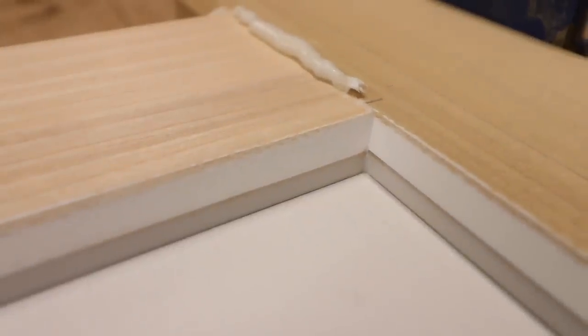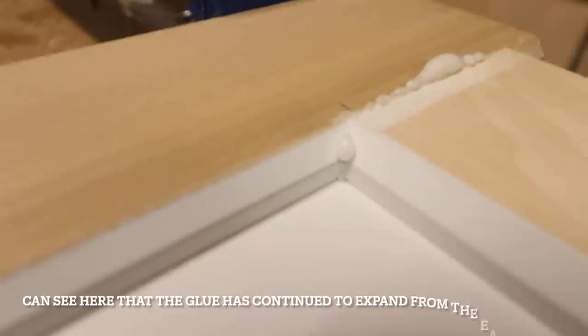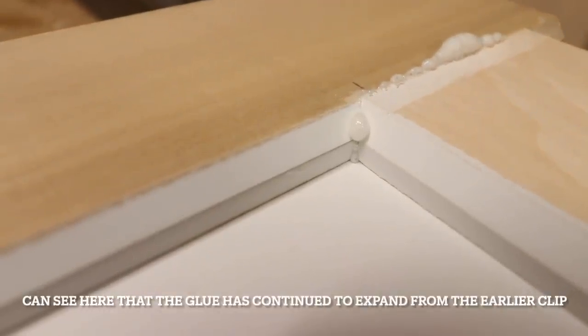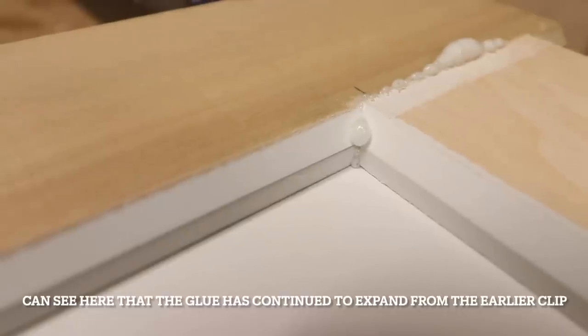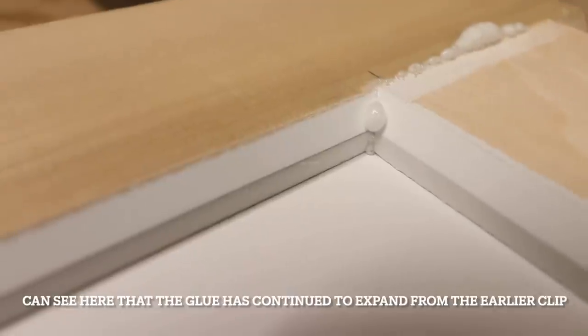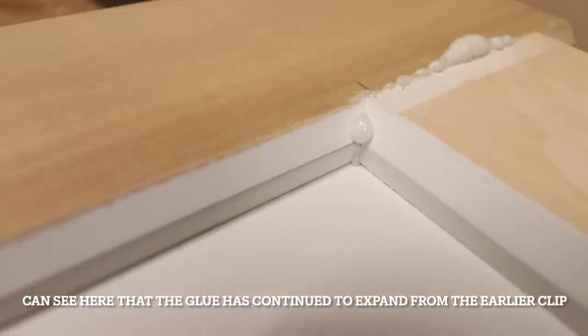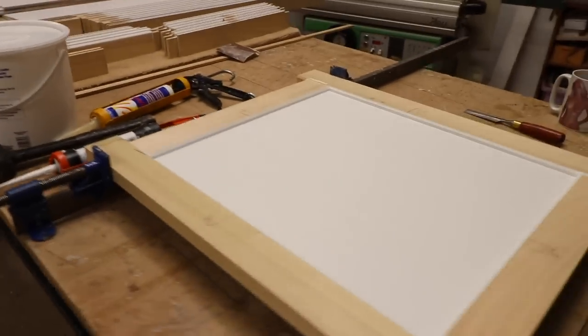That joint I can now just spray with a couple of coats of paint, de-nib, and I've got my finished cabinet. Whereas this joint here I've got to carefully trim that glue off now — once it's dried I've got to wait, take it off the bench, then put it back on to clean the glue. That uses a lot of time and also runs the risk of — if you're corking joints afterwards — it's quite a weak thing to do. You're only putting stuff on the surface, whereas if it's actually within the joint itself you've got a nice strong bond for the filler or cork that you used.